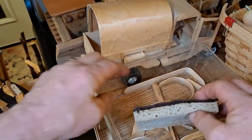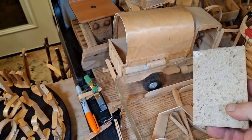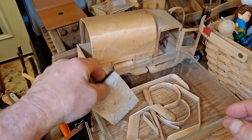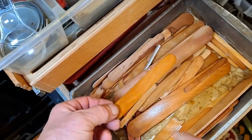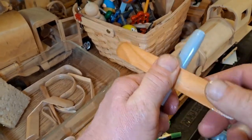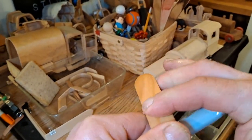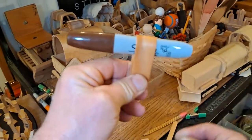Just like this sponge — the dry sponge, hard and stiff, representing the popsicle stick. The soft sponge representing a stick that's full of water — and it becomes flexible. Let's try another one. Tongue depressor — it's got some long grain, this would be a good one. Sometimes you can bend two at a time. Let's see what happens without the bending strap. I didn't need it on this one. And clamp.